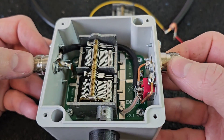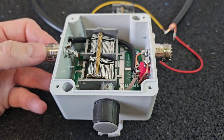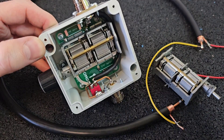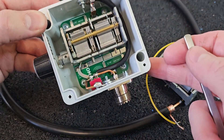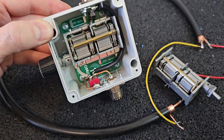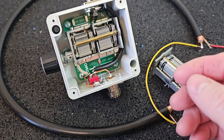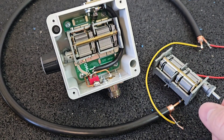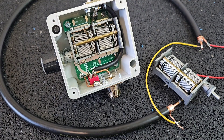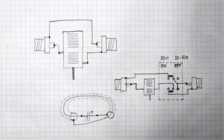After switching, a double loop version for the 80 to 60 meter bands is created. In this way I get double the inductance, but also the capacitance which is naturally found in every coaxial cable between its core and braid. It remains questionable how effective this antenna is when transmitting on 80 and 60 meters, but it is great that after the modification it can be used at least for reception on those bands, which was not possible before. Let's take a closer look at what this experimental modification looks like and how it worked in practice.